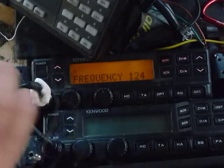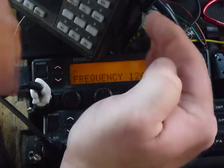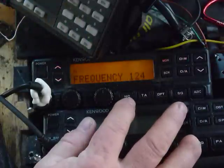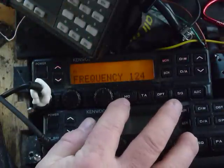What we're going to do is adjust our squelch window — the lower and upper. We're going to move that up, and that'll make it so you're not blowing squelch all the time, and you don't have to run your squelch all the way high.